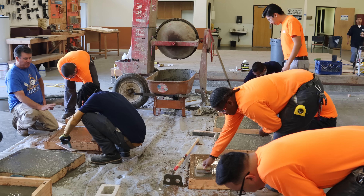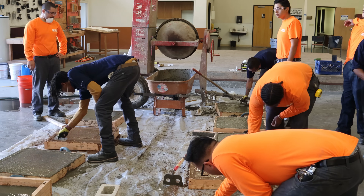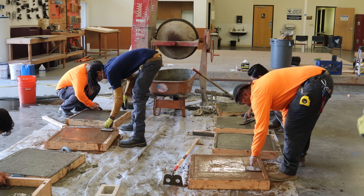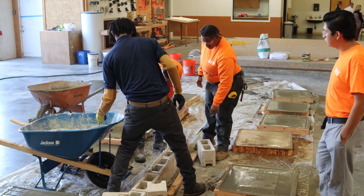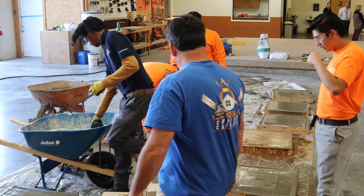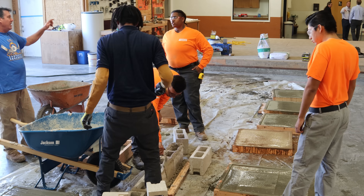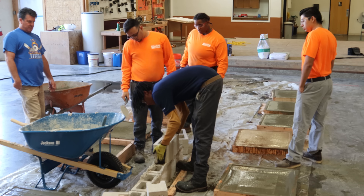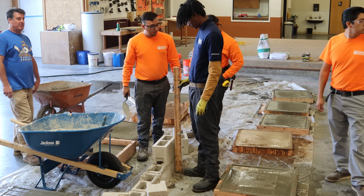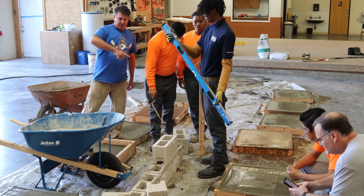While the concrete is setting, we're going to build a little block wall right down the middle of all these pads and stepping stones. We don't want to use a regular mortar mix with cement because we want to be able to disassemble the block relatively easily and potentially reuse it for the next class. So we're using just sand and lime. Apparently that's what they used to build the Egyptian pyramids — lime and sand — because they didn't have cement at that time, but they had plenty of limestone, and it seems to have held up pretty well over the years.